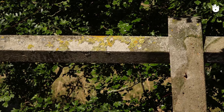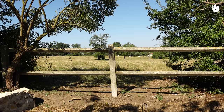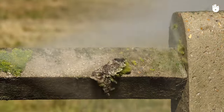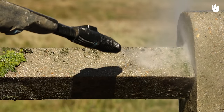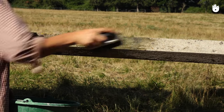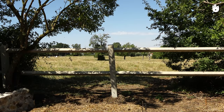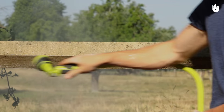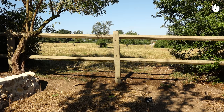In this case, we are going to whitewash a rough concrete fence. Begin with cleaning the whole surface you are going to whitewash. You can use a high-pressure cleaner or a wire brush to do so. The surface has to be perfectly clean and free of all moss or lichen. Moisten the surface 24 hours before you start coating so that the water penetrates deeply through the base.